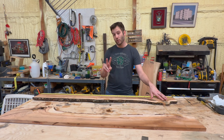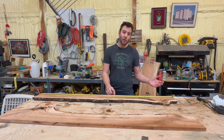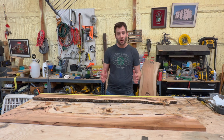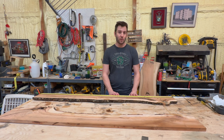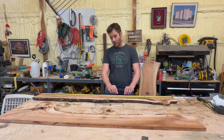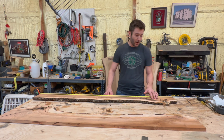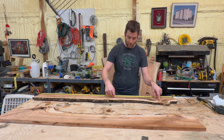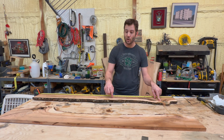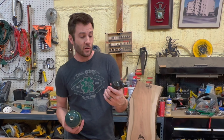I've got all the main parts chiseled out with my screwdriver and chisel. Now I need to decide two things: one, do I want to do anything with this flat edge? I could router off an edge, but I'm going to leave this one simple — just a squared-off edge — and I'm probably not going to torch that edge either. It'll just be a straight plain edge in the nice black cherry. I am going to torch all of the openings, including this beautiful opening here that turned out bigger than expected.